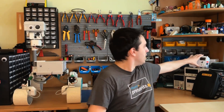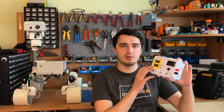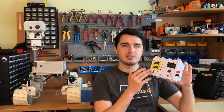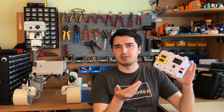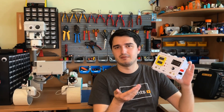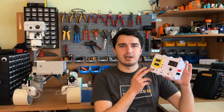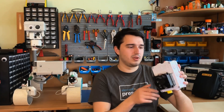Before we get to the main topic of this video sitting next to me, I'm gonna show you some of my older Arduino projects first. Let's look at my constant current load. It's a great piece of test equipment that you can make rather easily using just analog components, or you can put an Arduino into the mix as I did. It lets you program a device to draw a constant current from a power source, which is really useful when testing circuits, power electronics, batteries and stuff like that. I used an Arduino Nano 33 IoT in this device because it has an integrated DAC, which was really easy to integrate with the rest of the electronics, and it proved to be reliable and a really useful piece of test equipment.